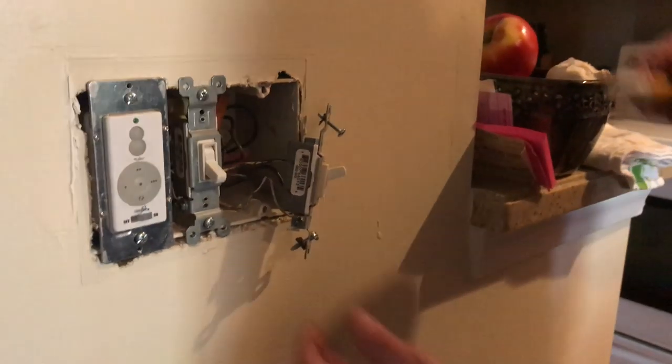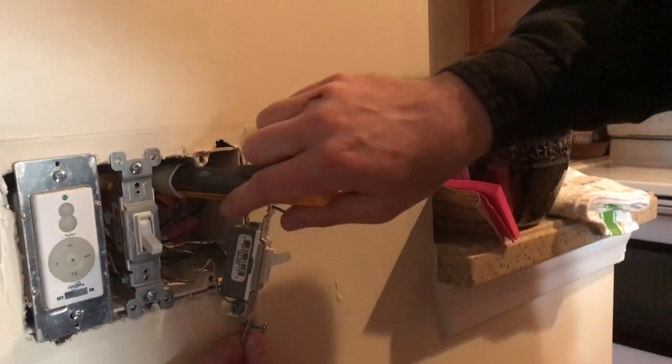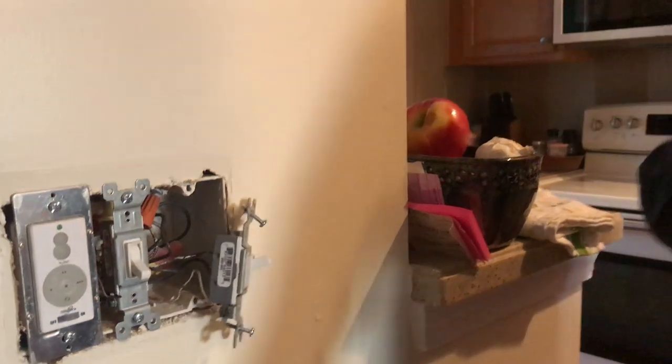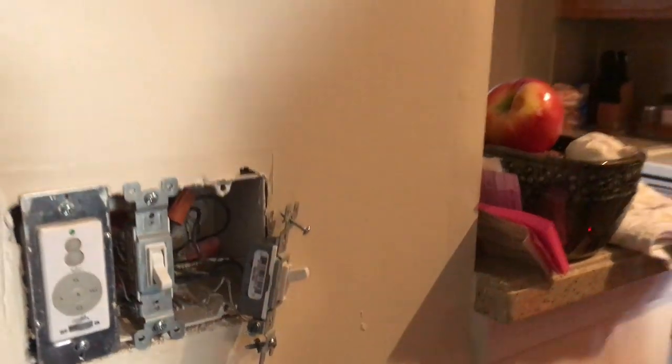Just going to test and make sure that everything is dead. My favourite test — a little bit of static, known supply. I can see it works with the electricity here, so when I test it here and it's not flashing, I know there's no power there.